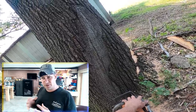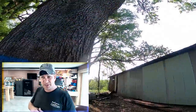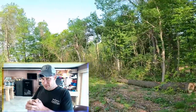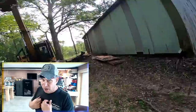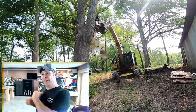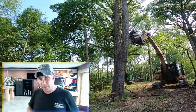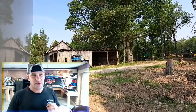Steve had to give me some Jones fittings. He's doing his best, but he had to give me some Jones fittings instead of our normal Eaton fittings. And our crimper don't match up, and I didn't know the proper crimp to crimp it at, and neither did Steve. Steve's like, well, do the best you can. And I didn't crimp it enough. The hose blew apart, and everything went to Hades. So, let's tear into this.